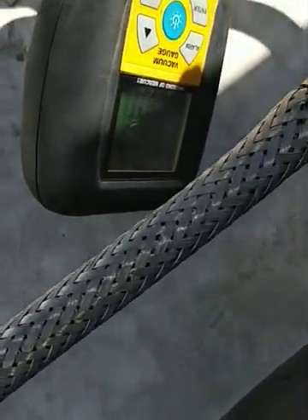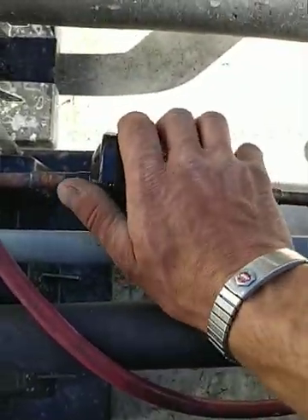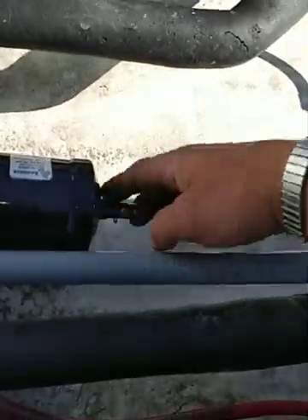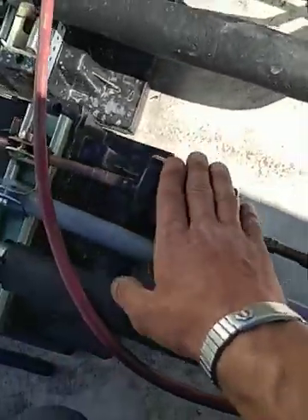There's my first alarm — we're already pulled down, so now I'm going to set my low alarm. Normally you want the dryers by the evaporator because on the high side you have hot liquid coming through, which starts to break down the desiccant inside. You want to get a little temperature swing — 10 to 15 degree difference from the condenser to the evaporator. But like I said, they wanted them here on this job. Always make sure that flow is going towards the evaporator.